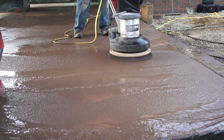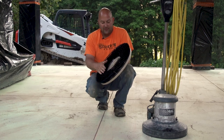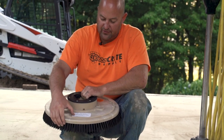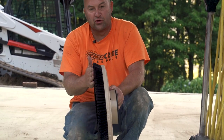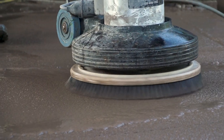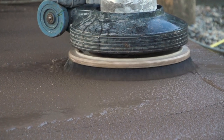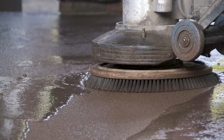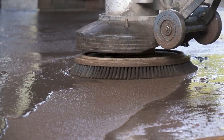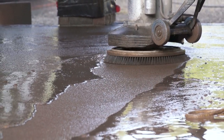For this technique, what we're going to do is take an attachment for the bottom of this — a stiff bristle brush. It's a polypropylene scrub brush with pretty coarse bristles. This is going to spin on there and loosen this up, so that when we pressure wash it, it washes off a lot easier. On this particular job, it'll probably save us about 30 minutes, but on a big driveway, this method will save you hours of time. It's a very cheap investment to save that much time.